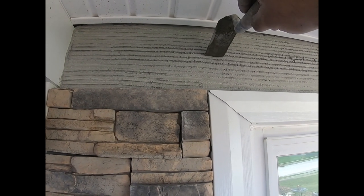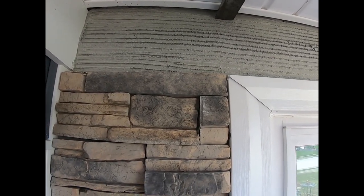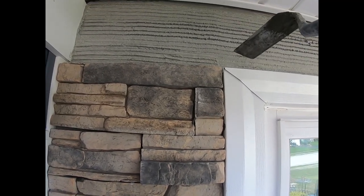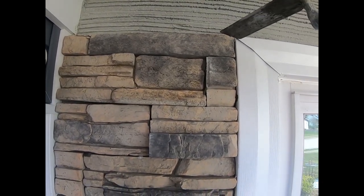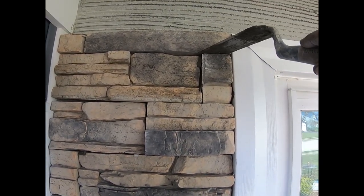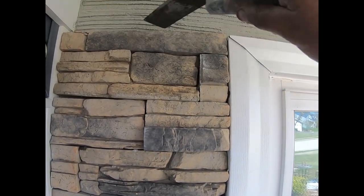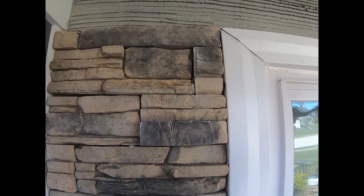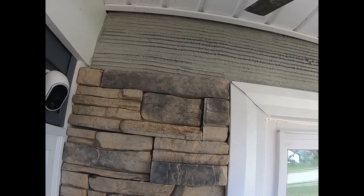I dry stacked the stones on the top of this window to see where they'd land with the soffit, and it's literally a quarter inch shy of two perfect stones. So instead of cutting a corner slot and then having to cut a short piece on top of the whole window, I've opted to go to this level — this is an entire stone right here, and this is a half rip. That gets me level with the window, so I can run straight across a lot easier.